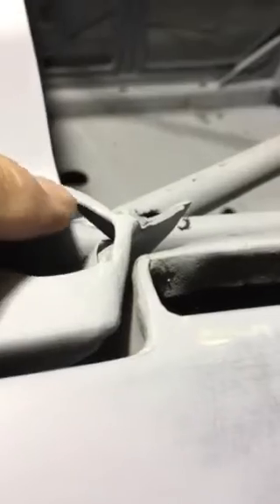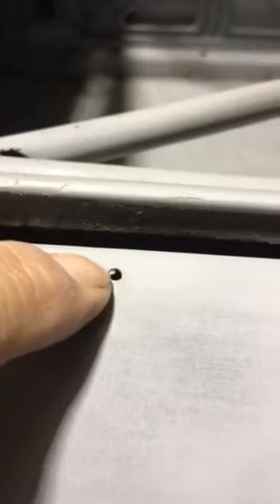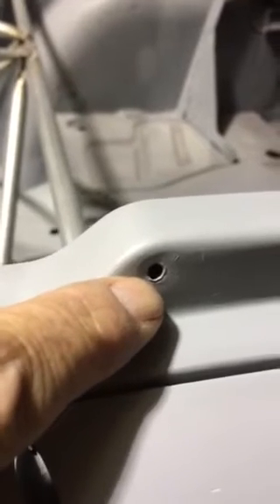You've got to pay a lot of attention to this spot right here — make sure you don't have any cracks, make sure it's good and strong, and pay attention to stress fractures around in here. Also make sure that when pop rivets were drilled out the holes weren't drilled out oversized, because then the male part of your snap won't grab the metal. Always check your rivet holes. Sometimes they're sunk in from previous owners, so I'm going to back this up with a small bolt and nut and ease it out so it's flush.